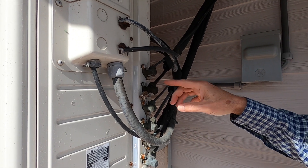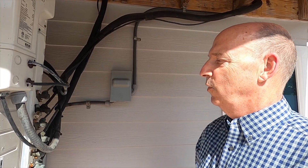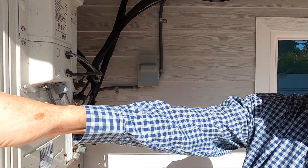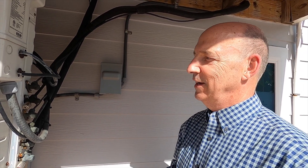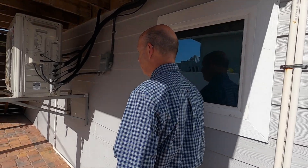This looks like a two-ton unit. Here we start seeing some downsides — it has three different air handlers inside with three sets of refrigerant lines, and personally I think they're rather ugly. There are holes drilled all over the house. When we install something like this, we use tubing benders so everything has sharp, straight 90-degree angles, but these are just hand-bent and flexed around. There's another unit on the other end of the house doing the same thing — mechanically it seems busy, but the alternative is having no room for ductwork.